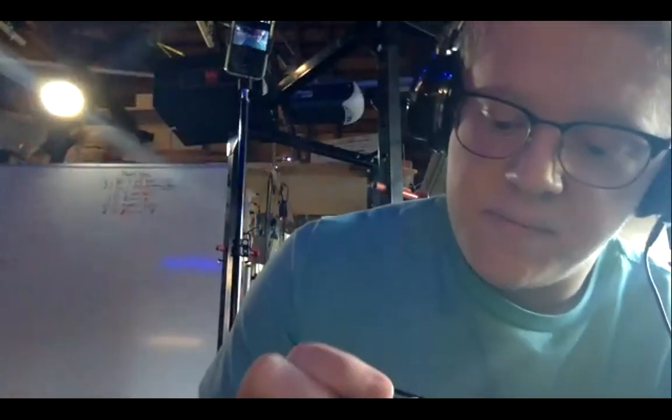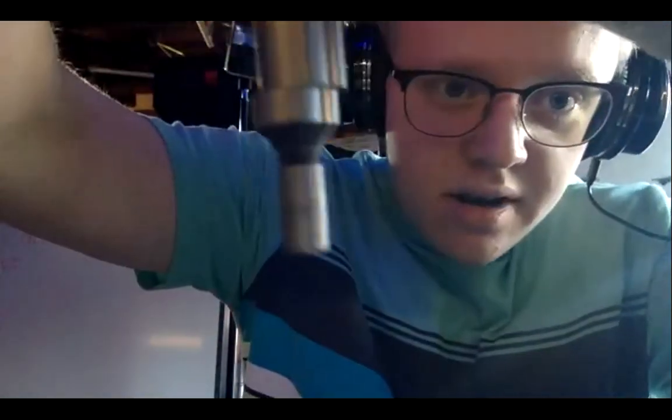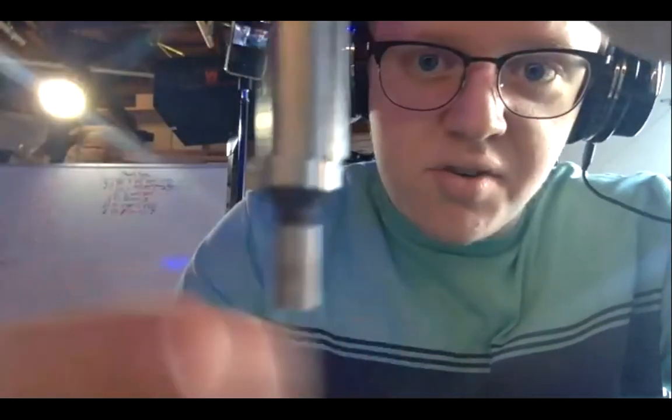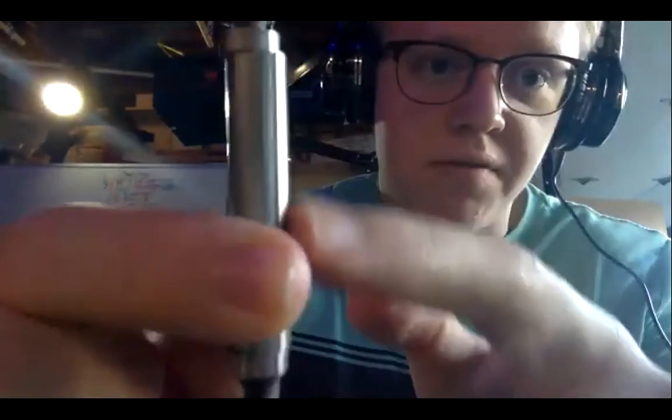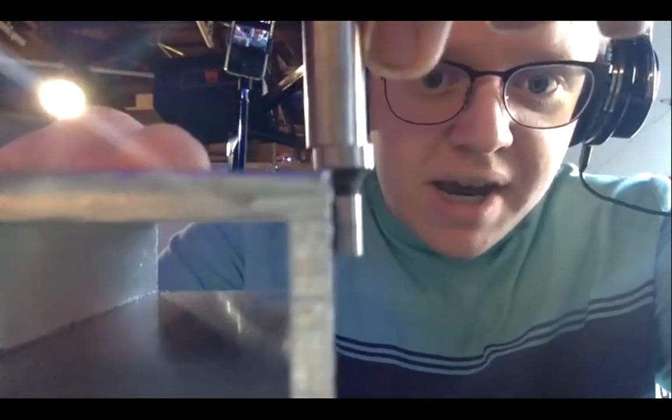What this does is you move the edge. Well, first you stick this in a drill chuck, the same way you would for putting a drill in a drill press, except you put the drill chuck on the mill. And once this is in the drill chuck, it spins around. And so that's offset like this. You're going to see the difference between the center of this cylinder and this cylinder. This is going to spin really fast depending on how far it is from the actual center of this tube on which the drill chuck is clamping. And as you move it closer to the edge of a part, for example, it's going to move the edge finder closer and closer to being accurate. See, I went too far that time, but you can get the picture.